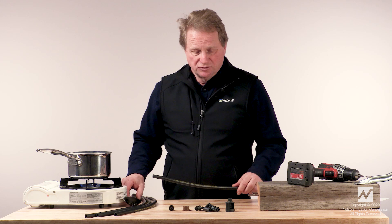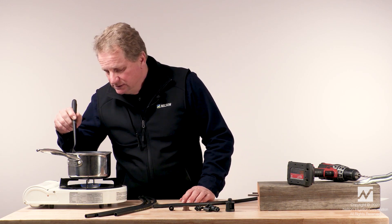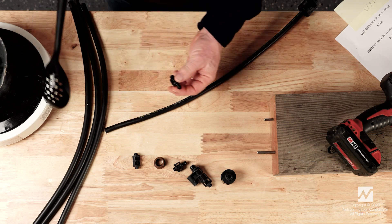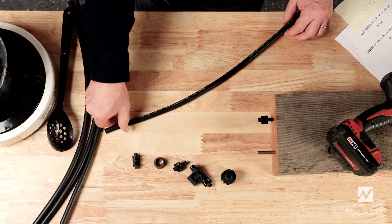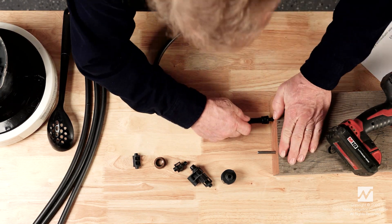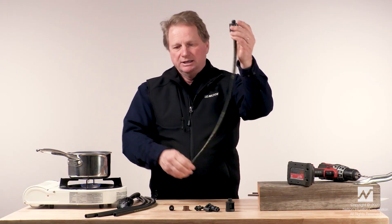Next, I'll demonstrate installing the LTO to the tubing. I'll pull one of those out of the hot water. That one is placed on the smaller diameter rod, which is the 3 sixteenths rod. Again, just a brief dip of the tubing into the hot water, and push it on — it slips on quickly and easily.